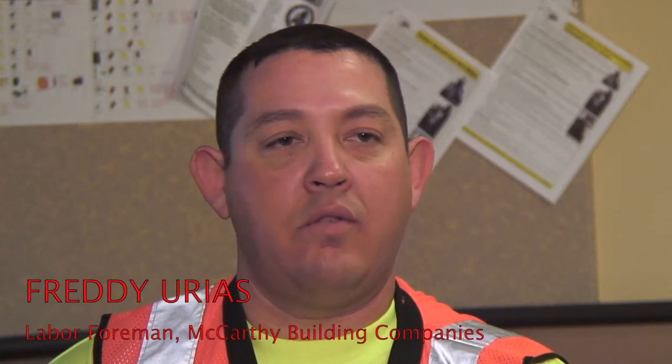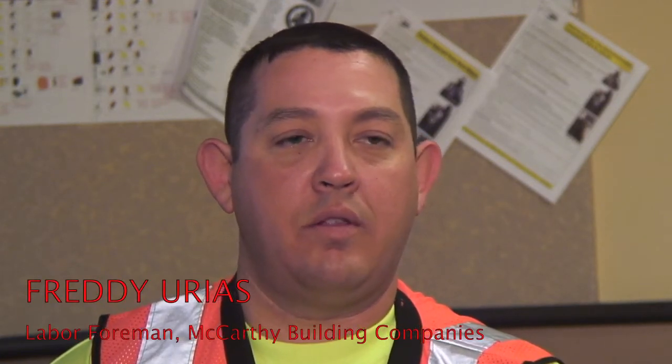The men named their own machines — Gertrude, Bill, Mary, and so on. They had these machines and they protected them, took care of them, and really appreciated the fact that we were using them and the reason why. Silica is harmful and it can kill you. With this system — the drill bits, the vacuums, and the drills together — it allows you as a worker not to be exposed to it at all. Trying to eliminate one of the bigger hazards on a project like this, and not having to worry about the long-term effects of silica, was big for a lot of us.